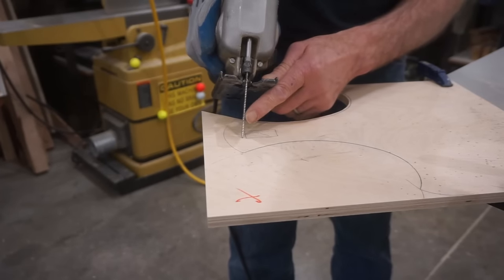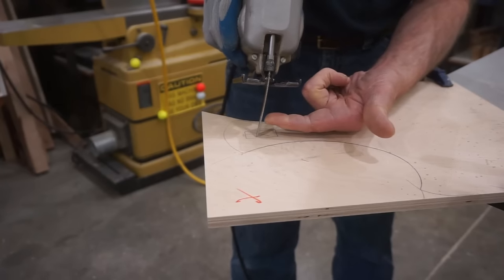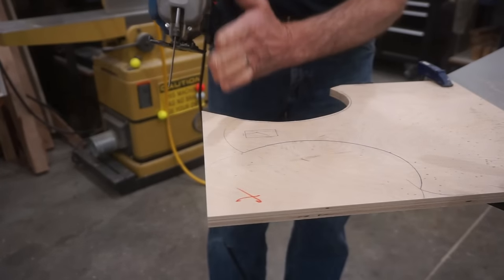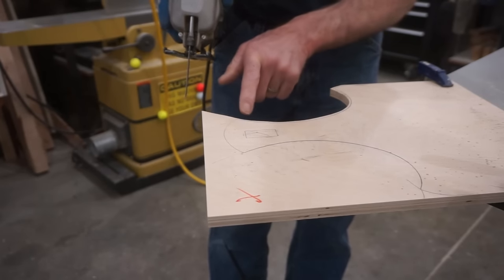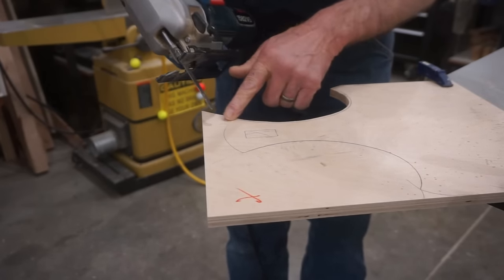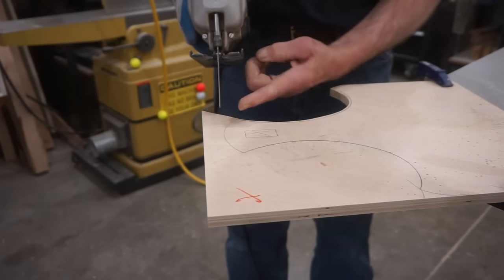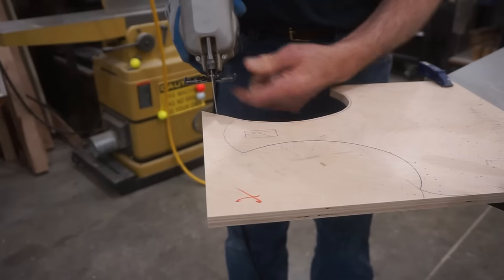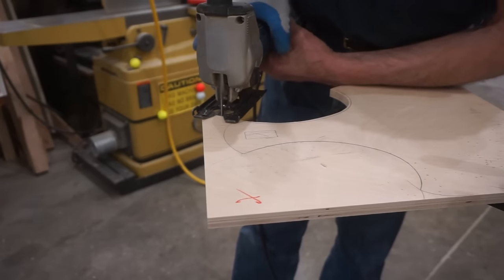So when I'm making the cut, I always opt to put a little inward pressure on the saw to put a little outward flex on the blade to make sure that the cut line doesn't undercut the pattern line and spoil the workpiece. And I'll demonstrate the difference here while I cut the arc for the top of the tool tote end. First, I'm going to cut with pressure outward on the saw, which is backwards, so you can see what that undercut looks like.